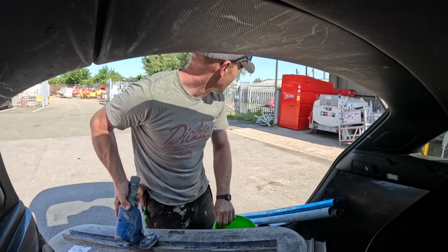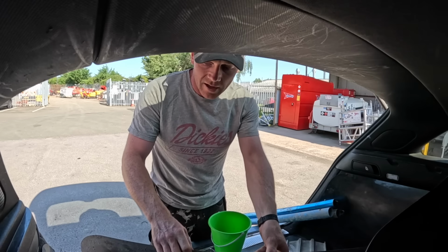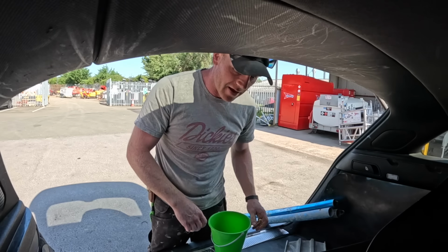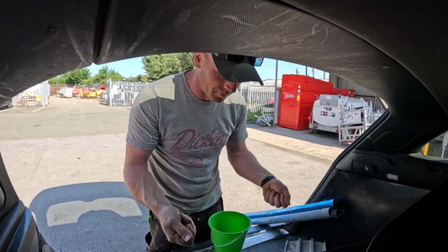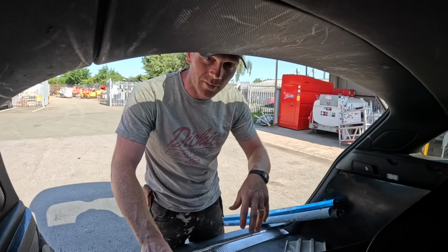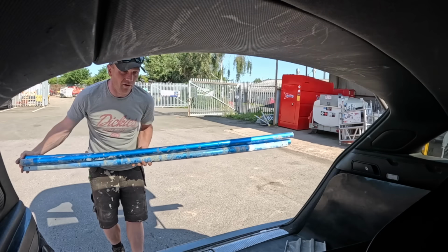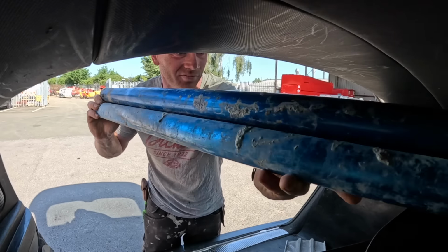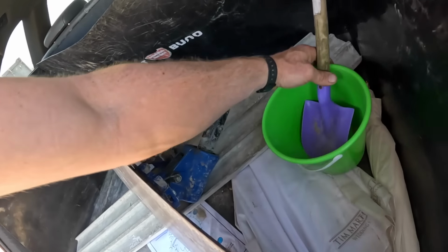What we're going to do next time is use a vibrating Maggi screed, petrol thing with a long bar to actually screed and level the slab out, and then probably ball float it a bit, followed by a power float, which is like a helicopter whacka whacka thing. But they don't have one of those, and that would be a nightmare to get into the pool. We'd have to lift it out with a digger. This is perfectly fine for what we need today or tomorrow. Joe's poor car. We'll use the bucket and the spade for any fine detailing work.